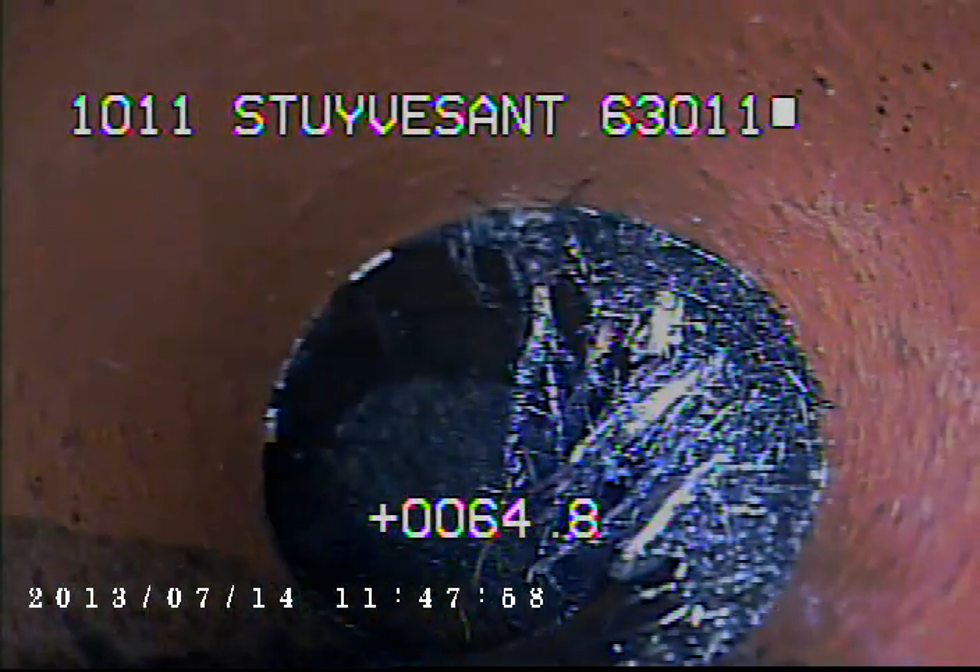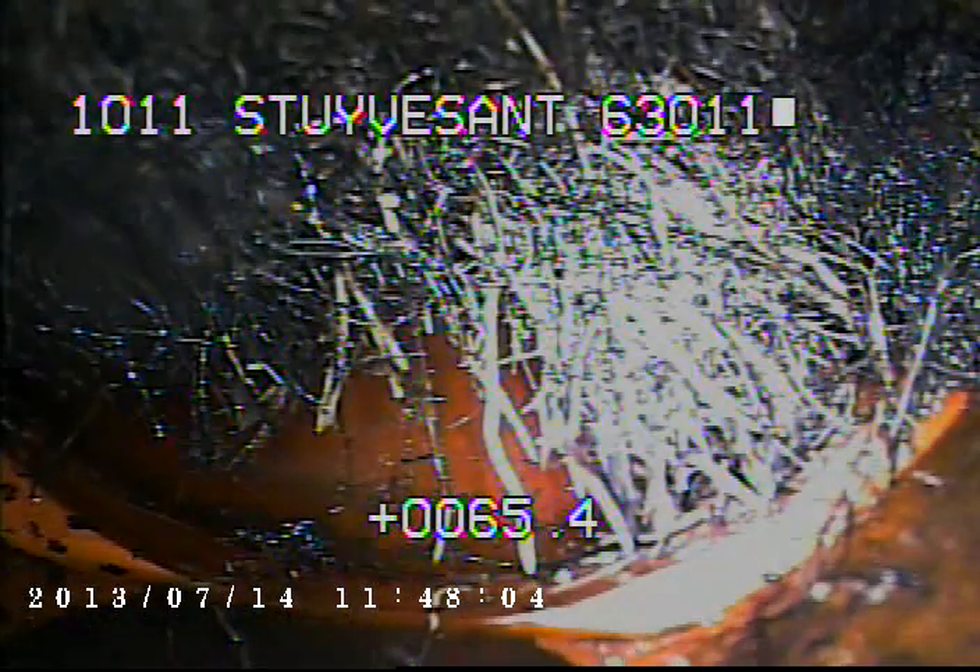When we come back, we actually go back into a 4-inch line. The problem is I can only run a 3-inch cutter into the sewer line to try to cut out the roots. When we go into this 6-inch line and then into the main, the cutter simply can't grab the roots.